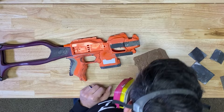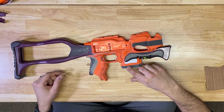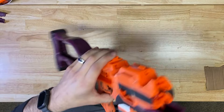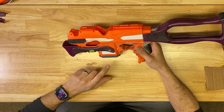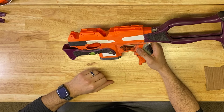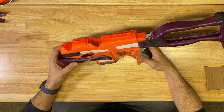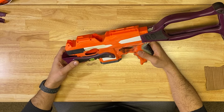Work has been done. We have those on, they look good, they've been sanded flush, everything's been filled in. I think we're ready to lock the grip on finally after doing a ton of stuff. We've sanded this down to a wet sand of 320 so far, so that should be good enough for now. I think this is fitting really nicely — I'm really happy with how it's fitting after a lot of work to get it to that point. Let's go ahead and mix up some DEVCON and get it on.